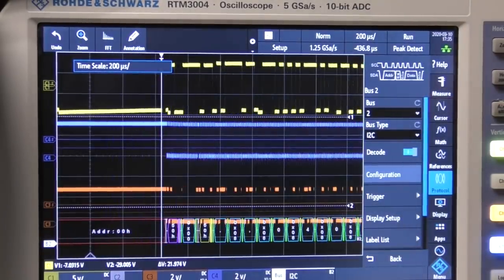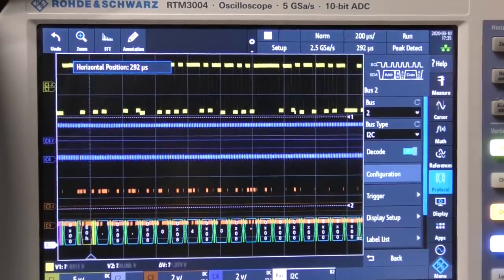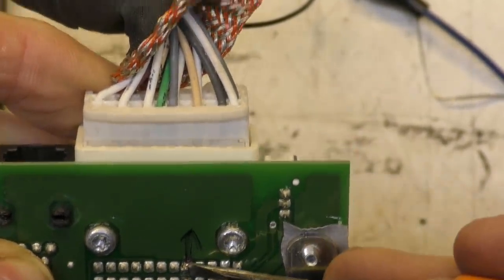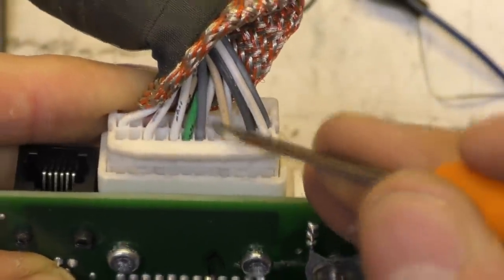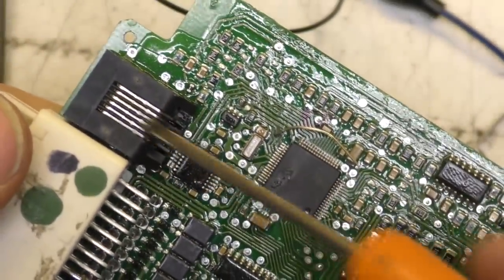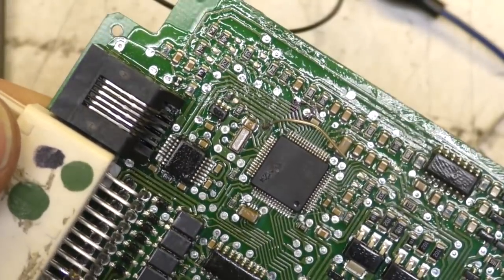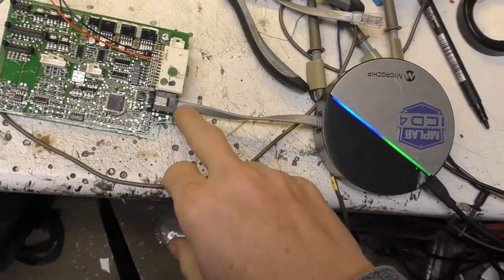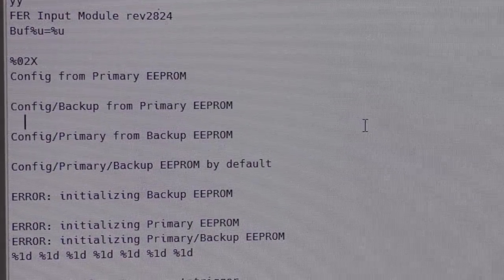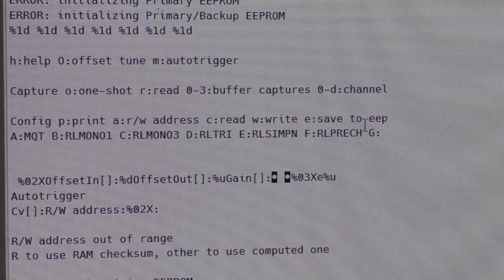We get a little bit of startup text out of the serial port: 'input module rev 2824' and then 'config from primary EEPROM.' There's a little five-pin SOT-23 device with 2k2 resistors — that's giving an I2C EEPROM. Looking at the I2C bus you can see it reading all the I2C data from the EEPROM. The RJ11 is actually for PIC in-circuit programming — not serial as I assumed — and there's about 8k of code in there with some sort of very low level monitor functionality, but nothing particularly interesting.